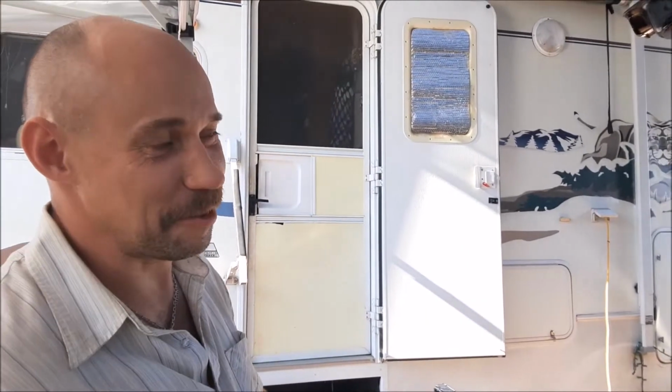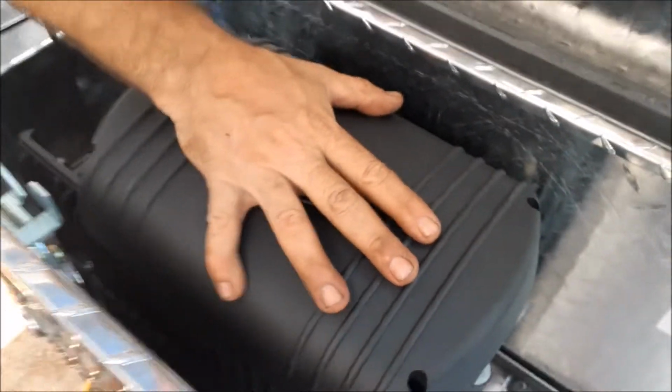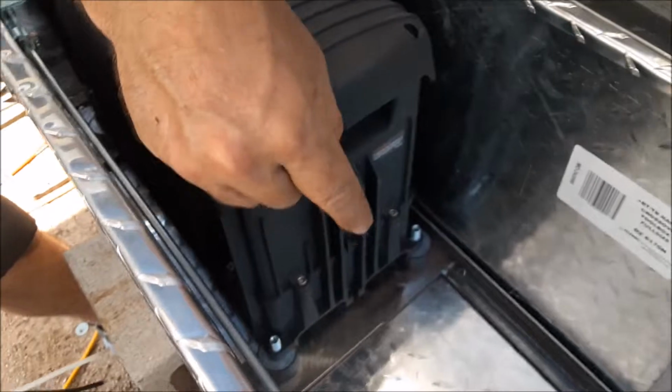Now the Outbacks, just so you guys know, some of you more involved application engineers, we did not have to put isolators on this Outback. The Outbacks are built rugged enough. We want to get into the practice of isolating electronics. It cannot hurt. $10 to overprotect your stuff. How much is the inverter? $2,000. We have a really good expensive inverter. We want to protect it, so we put isolators on it.